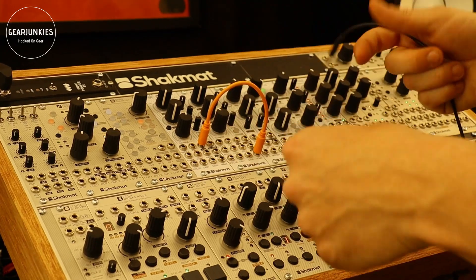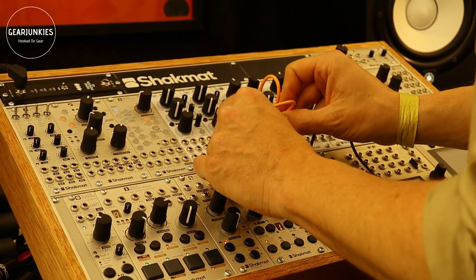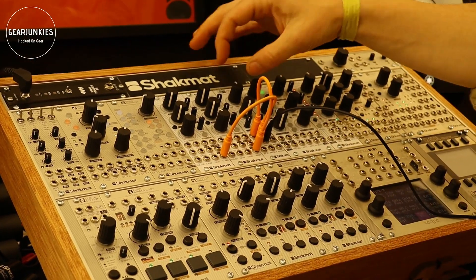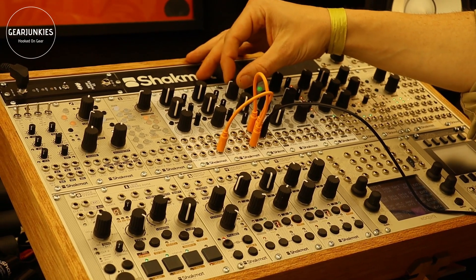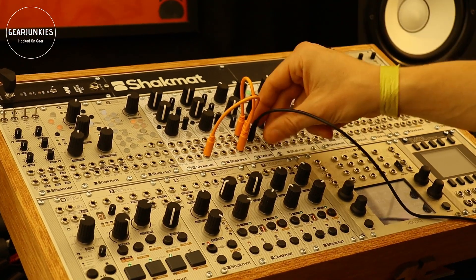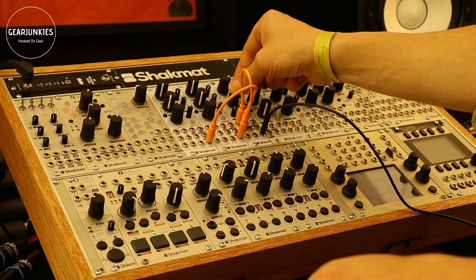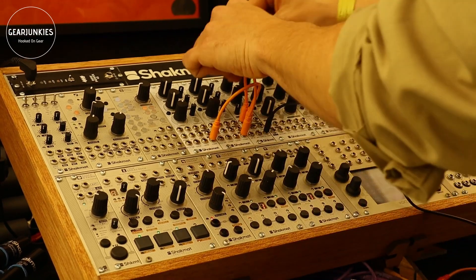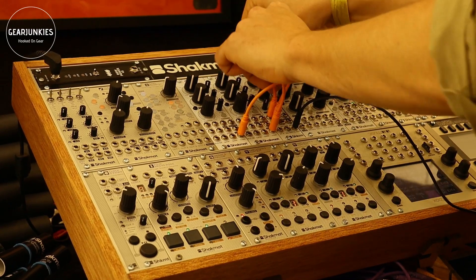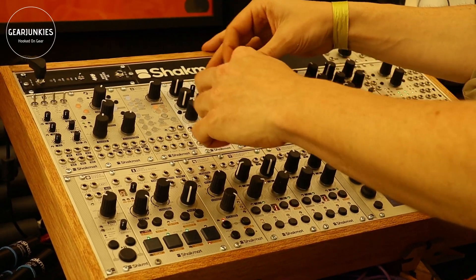Now that you have two VCOs you want to mix them. The Jewelacast is a crossfader module that allows crossfading between two sources and ring modulation. In cascade with this, there's a wave folder. So you can crossfade between the dry source and the ring modulator, and you can hear very easily some FM glassy tones with this combination.